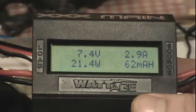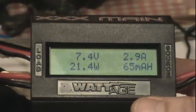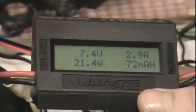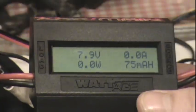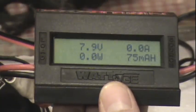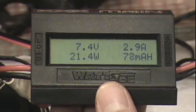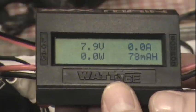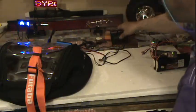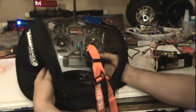It doesn't take a really, really powerful battery, or a huge C rating. These are a 4,000 milliamp battery. And if I only draw a constant, so that's getting really hot in my glove, right? There. It just turned off. See that? It's quite warm in my glove right now, but the heater turned off. Now if I turn the dial up, turn it back on, it draws that 2.9 to 3 amps. I turn it off, I can turn the heat off. It completely shuts down. So that's showing what the draw is like and how easy the system actually is to run on these batteries. It's not that hard. It works very well.